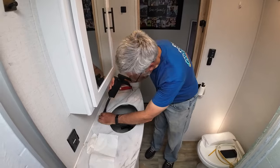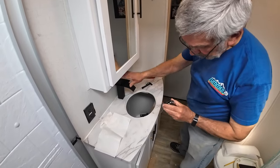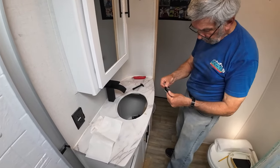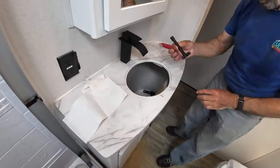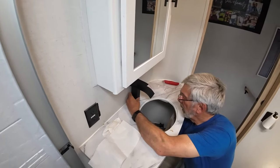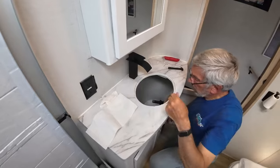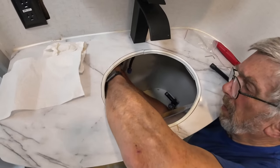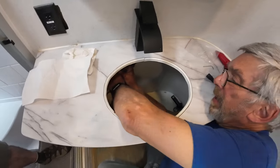This is going to be a pain, but putting the fixture back on there — the faucet is just held in with these C-type clamps and the screw that comes up underneath tightens it up in place. So while this thing is out, we'll install that and get it snugged up. There's just a fancy little wrench that comes with it. Then we've got the water lines down in here — hook those up while we're here, hot one over onto the red.